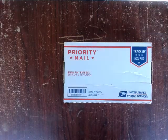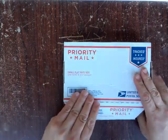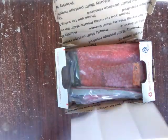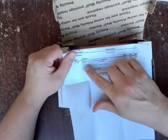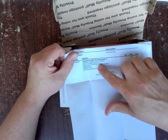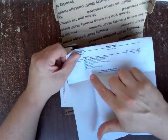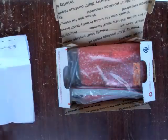Alright, so I waited quite a long time and I finally got my X5 Mini version 3 from Azteeg. I'm going to open that up — this is the shipping manifest. The options I got were soldered connectors, a 4 gigabyte SD card since I didn't have a micro SD, I went with the 5984 stepper drivers which are a little less current than the 8825 but apparently smoother, and I got the Viki LCD Mini with a 30-inch cable.